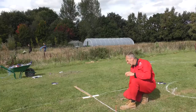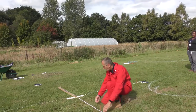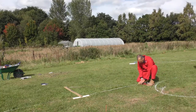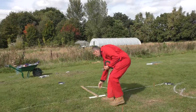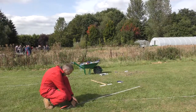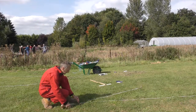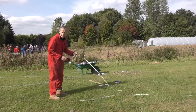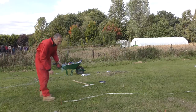What you do is take half the major axis — half of four meters is two. We swing this tape and where it cuts the major axis, that is where I now transfer this peg to that point. I do the same again over here. Where it cuts through, I've got my two meters cutting there, so I pull that out and pop it in. That forms my triangle. I need to mark out the rest, so all I need now is a piece of string to join it up and form the triangle.